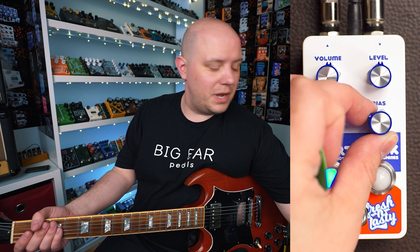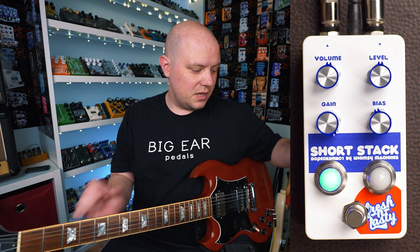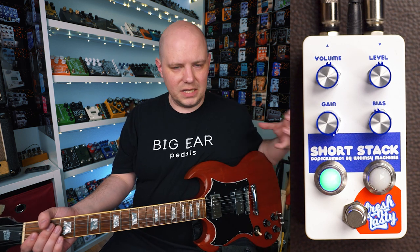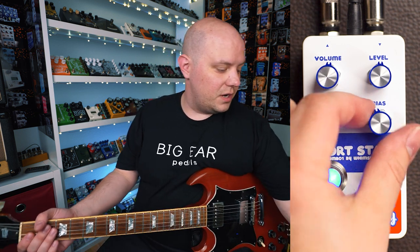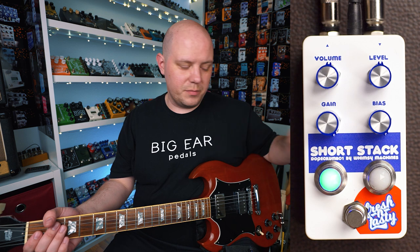That was an oversimplification of the bias control, but that's essentially what we're doing. We're moving that idle point to where if we starve it all the way, if we turn the bias pot down, we're starving the amplifier stage of power, which means the more we hit, the more it's gonna kinda sputter. Conversely, if we turn it all the way up, we're gonna push our signal all the way up, and then only the bottom parts of our waveform are gonna come through.